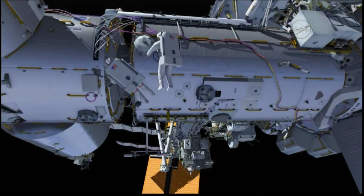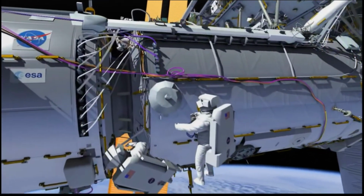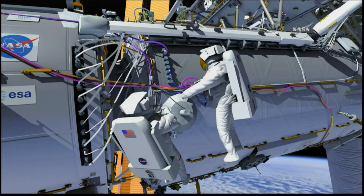Once Drew's at the worksite, he makes his way up to a set of power cable connections, and he releases an EVA power cable. That EVA power cable hooks up to the high-def camera power, and then the high-def camera power cable hooks back up onto the panel. The ends of that wire are wire-tied to a handrail for restraint, and Ricky receives a power cable from Drew.